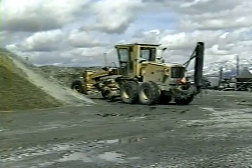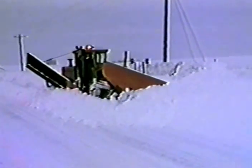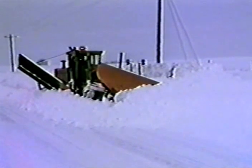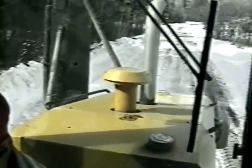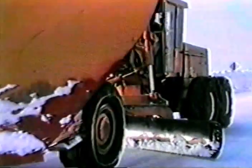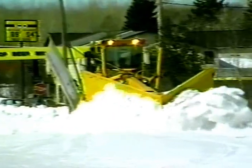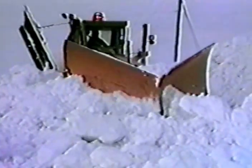The speed at which you travel influences how the snow moves across the moldboards. Too slow and you are a bulldozer; too fast and you crash. Considering your visibility and your own comfort level, maintain a good speed to keep the snow moving across your moldboards. The V plow is used to open roads when the snow is thick and deep, and it is easy to get stuck. The two most important points are: stay in the middle of the road, and don't let snow come over the V plow and fall onto your side.